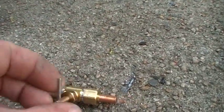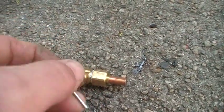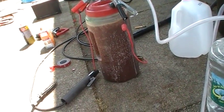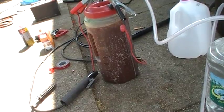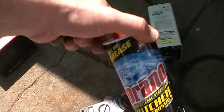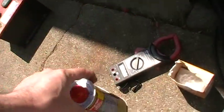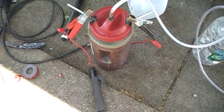The solution I'm using for electrolyte is really nasty right now. I made a mistake — I had distilled vinegar and I put some baking soda in it. It wreaked all kinds of havoc on my plates. They were totally jammed up with corrosion, everything was falling apart. As you can see, it's really filthy now — but that's the tail end of the plates being cleaned off. They were totally discolored, totally jammed up.